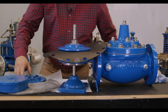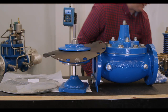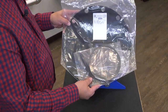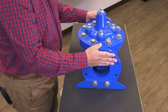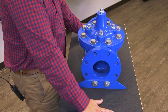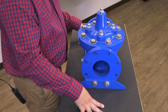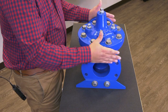Now let's get started with the rebuild of our Hytrol. The first thing we're going to do is confirm isolation — your inlet, your outlet gate valves, whatever your isolation is, butterflies, whatever that is — confirm isolation before you start to tear apart your valve. We've confirmed isolation.